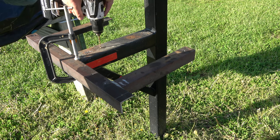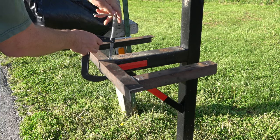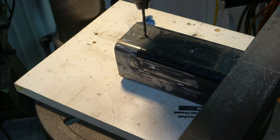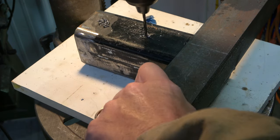I prefer using my drill press on such thick steel. These are the holes that will later receive the screws that secure the bracket. I worked the bit sizes up to a 3/16-inch bit, which will accommodate the size screws I plan to use.